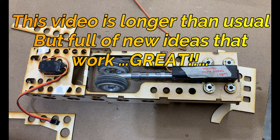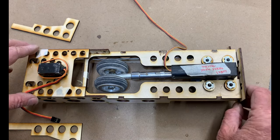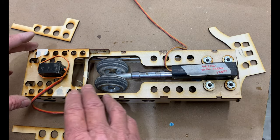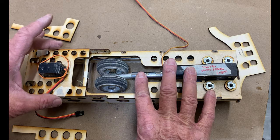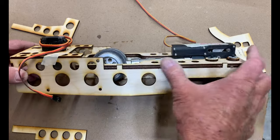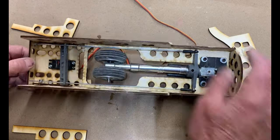I redesigned the front landing gear for the A6 — a couple of components. This is the top view. This is a reinforcing plate which goes on the back later on, same with these — they just give you more glue area to hold it in. So the servo has a little tray here which is totally removable; there's four screws. Right now I've just got it taped up with blind nuts on top, double layer of ply. And this is the inside — this is the way it works.